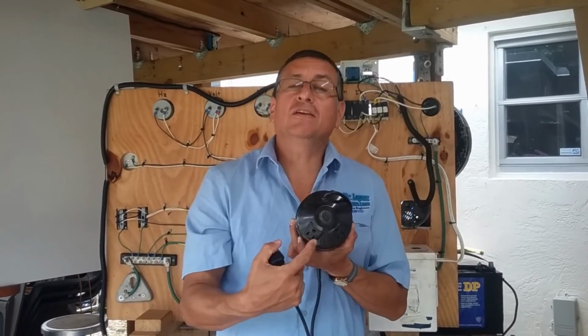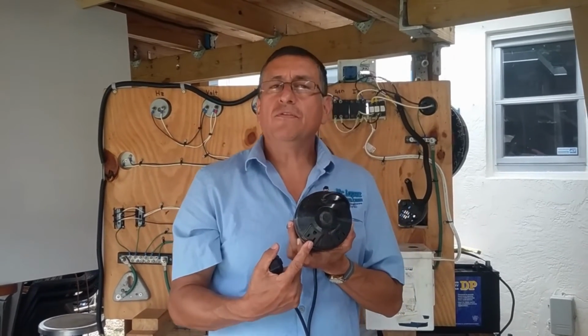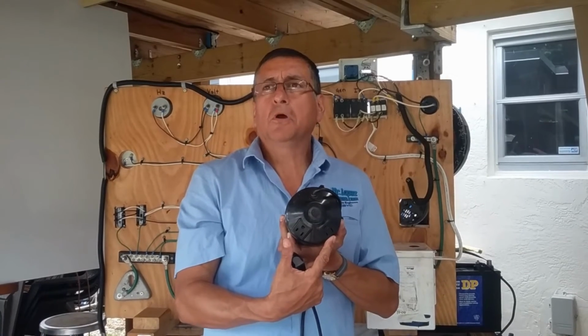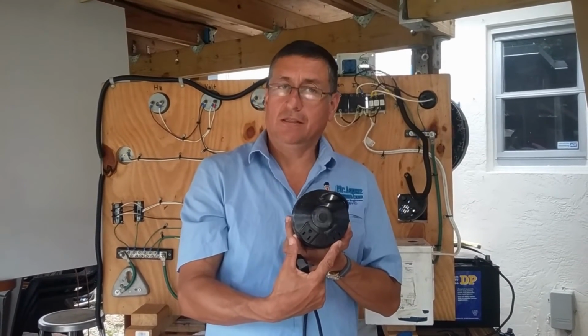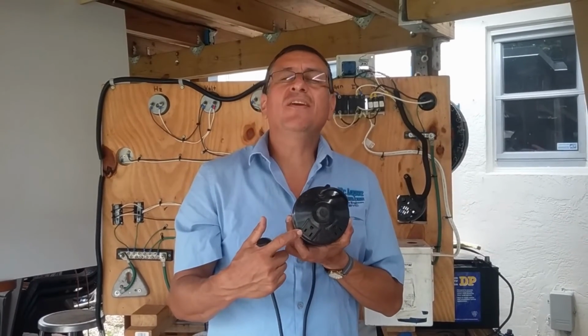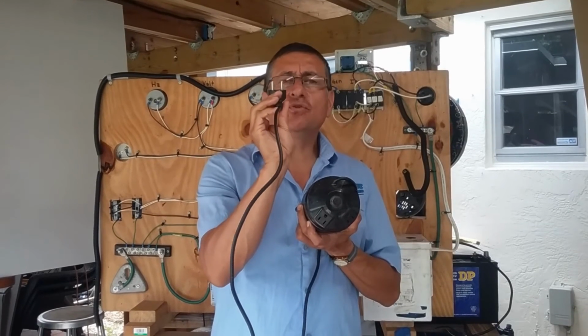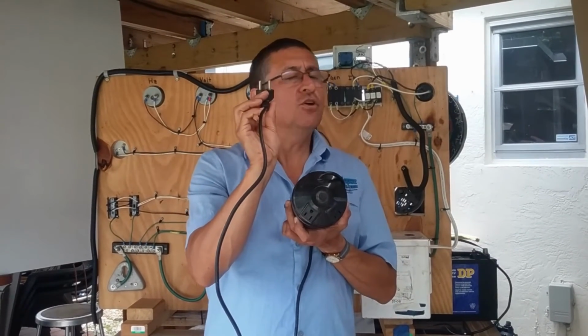What is the inconvenience with those outlets? Those outlets right now are 115 and 115. Okay, it's pretty close to 120, the American power. But remember, the frequency here is 50 Hertz because you reduce the voltage. The transformer is used to reduce the voltage, not the frequency.